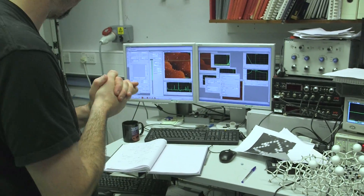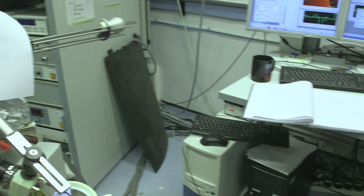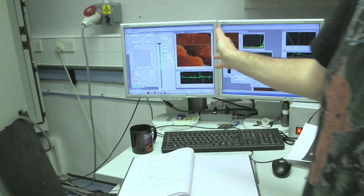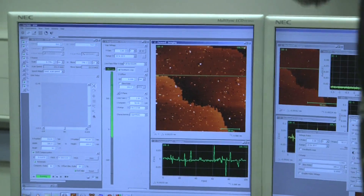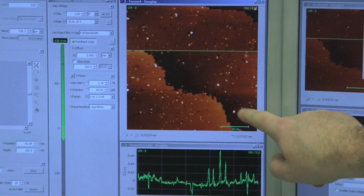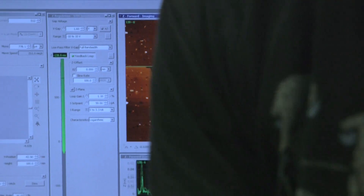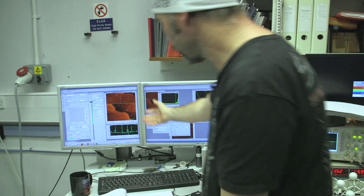What you've seen on the screen - this image that's building up - is happening right in here, which means we don't want to touch that machine, we don't want to walk into it or bounce into it. Our surface is not great. These little specks - and first of all this is 20 nanometers - these little specks are actually individual molecules, individual atoms that have come out of the vacuum. The residual gas in the vacuum is corrupting our samples.